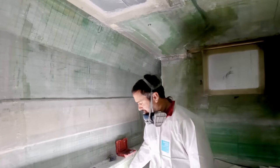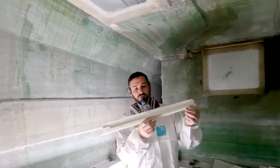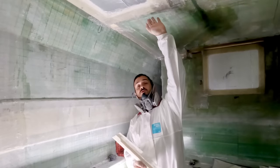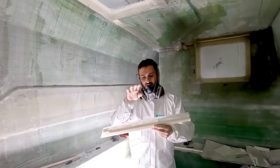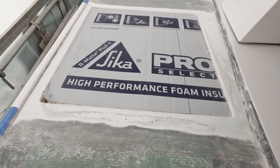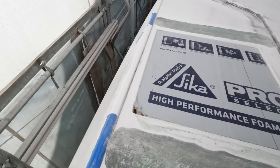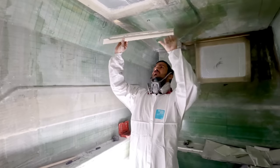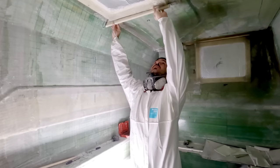What I've also done is basically a little quick mold for our drains for the hatches. Now the way the deck is shaped, I've been able to mimic that with our gutter to make sure that all that water is going to flow in the proper direction. It's not going to build up in this recessed hatch area, which eventually would allow it to pour down into us. Basically all it does is it goes right here.